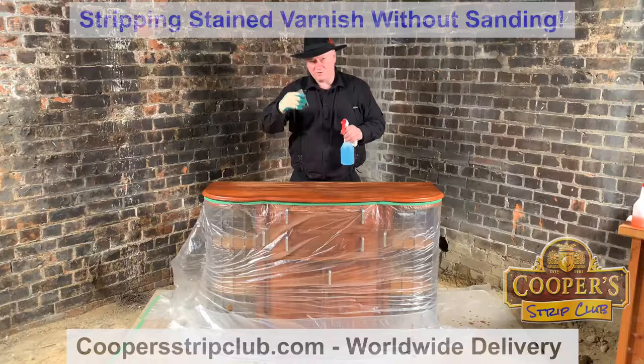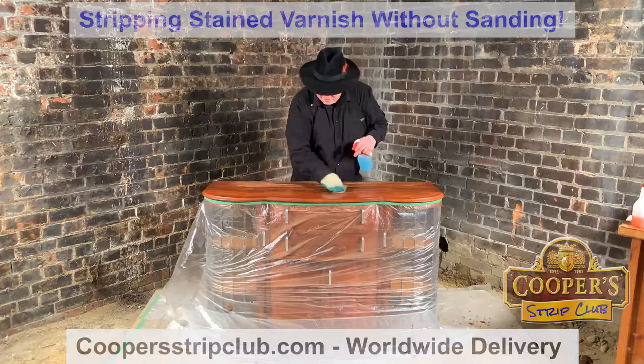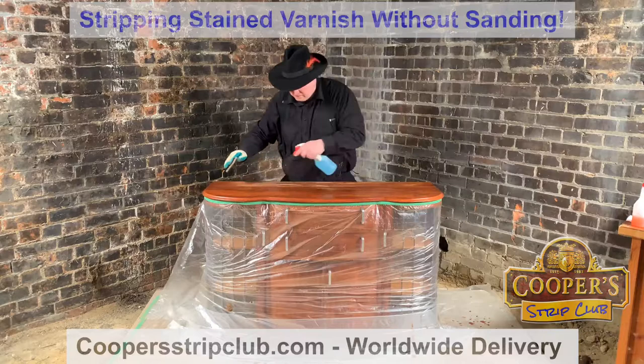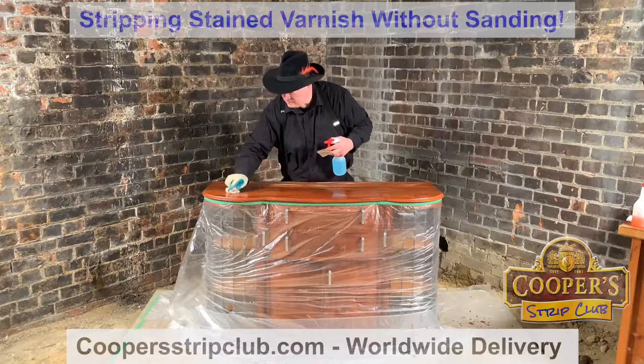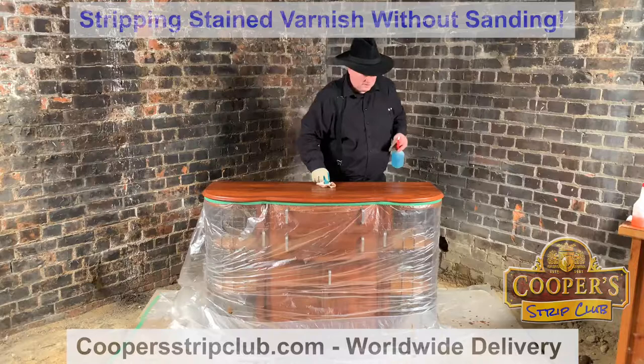That's the end of part two, so we'll be back in a moment with part three. The top's got thousands of little sandpaper marks in it and these grits are like a record player needle. So we spray the flusher on — unlike the stripper where we leave it for four or five minutes, you're spraying and scrubbing at the same time. The needles of the grit are getting into those sandpaper marks and sweeping it clean. This is a very nice honey brown colour.